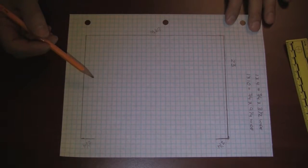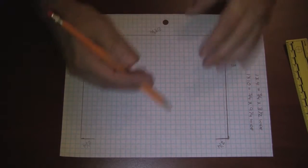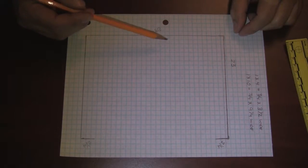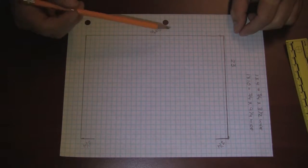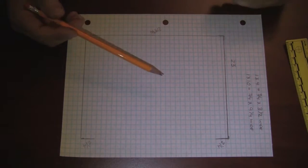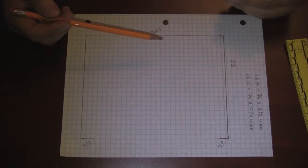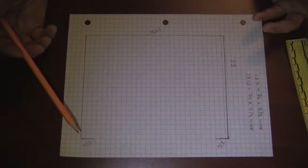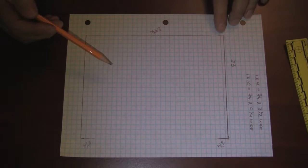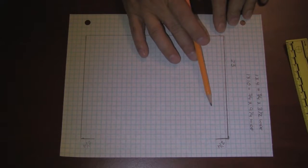1x4 on this side. And back here we can have however thick we want. This is the back of the pantry. Now, I always recommend one row deep storage. Keep the shelves as small as possible to fit the items that you're going to put. So I'm thinking, you know, a box of cereal is pretty wide. A 1x10 will work, which is 9 1/4 wide. So based on that, we know that we're going to go 3 1/2 here.